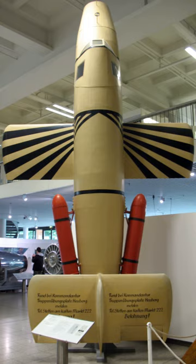The initial plan was to power the machine with a Walter HWK 109-509A2 rocket motor; however, only the 109-509A1, as used in the Me 163, was available. It had a sea-level thrust variable between 100 kg at idle to 1,600 kg at full power, with the Natter's intended quartet of rear-flank Schmidding SG-34 solid fuel rocket boosters used in its vertical launch to provide an additional 4,800 kg thrust for 10 seconds before they burned out and were jettisoned. The experimental prototypes slid up a 20 m tall vertical steel launch tower for a maximum sliding length of 17 m in three guideways, one for each wingtip and one for the lower tip of the ventral tail fin.